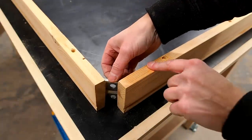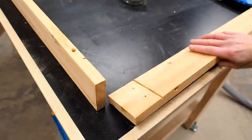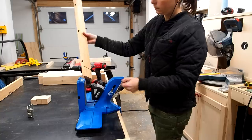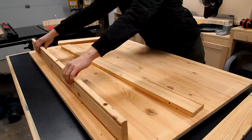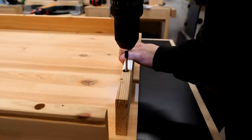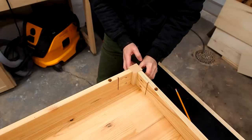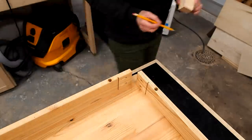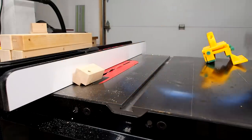Back to the tabletop now. I'm going to need something to hold the frame together, so I cut some small blocks to use as connectors, then drilled pocket holes into the aprons to connect them together. I'll start reassembling the table by screwing down the aprons using the original screw holes as a reference. I can then insert the corner block, but I need the inside corners to be perfectly square for the legs, so I'll need to remove a small notch — over at the table saw I'll carefully cut a small rabbet.